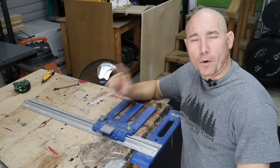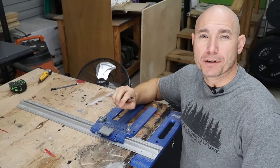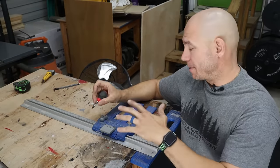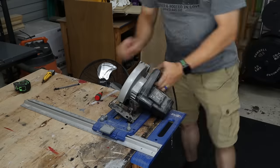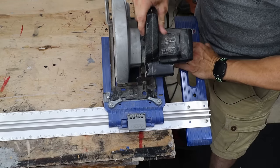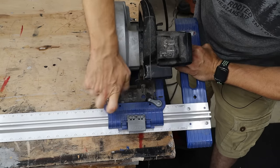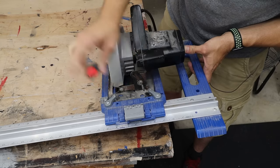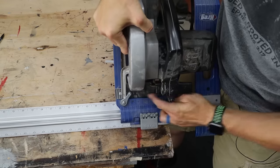Last but not least is the Kreg Ripcut — probably one of the best $40 I've ever spent. I like Kreg products; they don't sponsor me, I just like them because they're great for beginners and intermediate woodworkers. This will work with virtually any circular saw, corded or battery powered. All you do is slide your circular saw onto the mount. It has two screw clamps — just snug them down with a Phillips screwdriver on each side. It has a stop block you can adjust so the measurements are correct. Make sure the guard is on the raised side, everything is unplugged, and the saw is squared up against the front piece and pushed against the stop block, then snug the screws down.